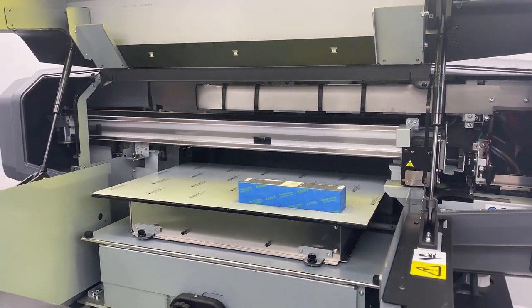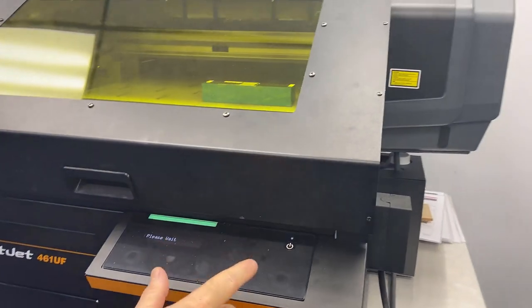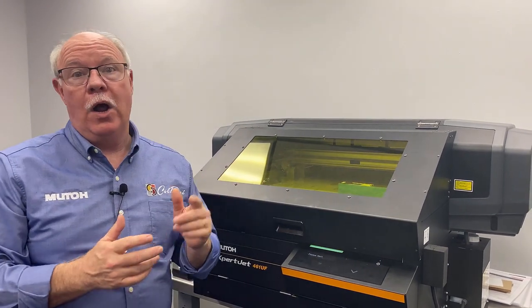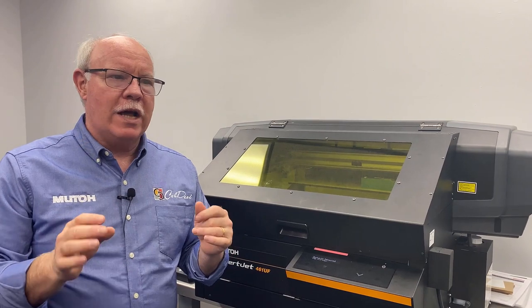What we're going to do now is go over here and set up in the software — the same thing we typically do with any of these. We're going to bring the artwork in and set it on top of that rectangle I printed on the bed so that it's positioned right. I actually oversized it by about a tenth of an inch all the way around so it bleeds over.